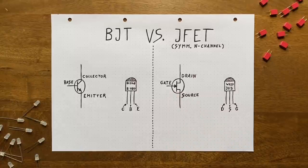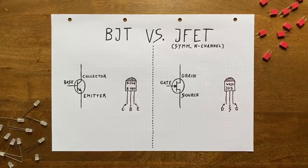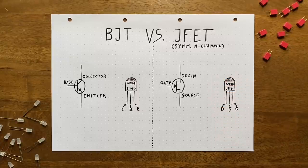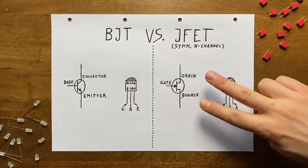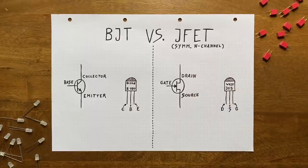The long answer is a tiny bit trickier though. As I said earlier, the direction of flow between drain and source can be reversed freely. And if we think of the source as the terminal that current is flowing out of, then source and drain basically switch positions once we do reverse the current flow. So effectively, the gate voltage is always measured in relation to the terminal that current is flowing out of. And that will always be the one where the applied voltage is lower.